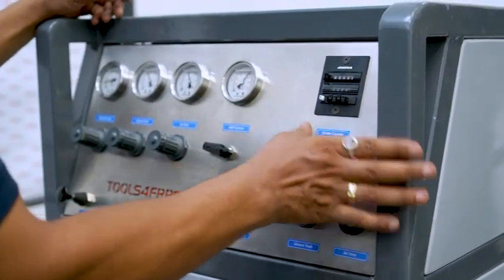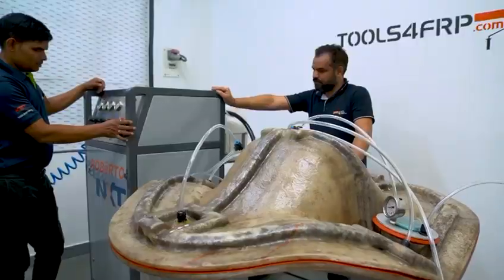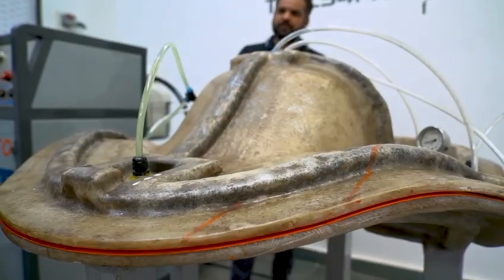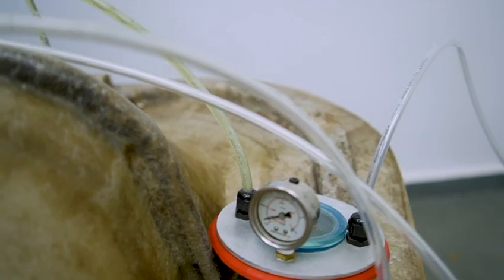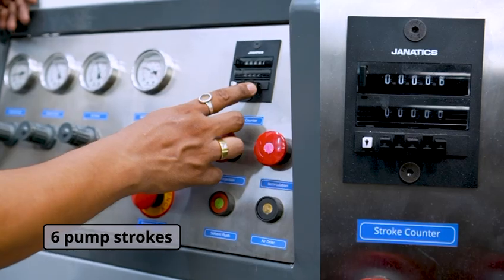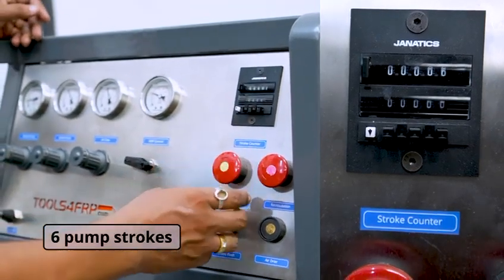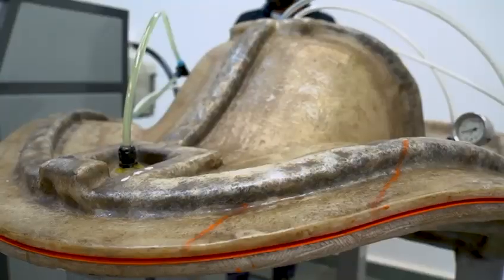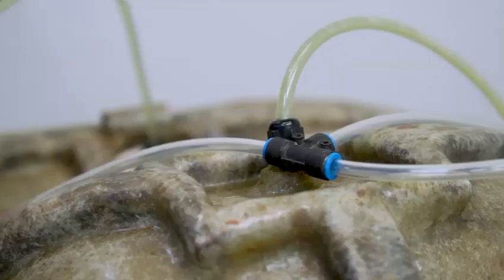Please start injection from Roberto NXT. As per the volume of the mold, we know how much resin is required. Making a quick calculation, we decide that six pump strokes will be enough to fill the mold and get a small amount of resin in the catch pot. This is to make sure that no dry area remains and the entire part and fiberglass reinforcement is wet.